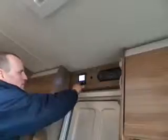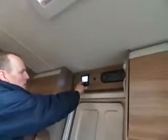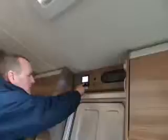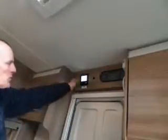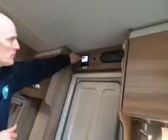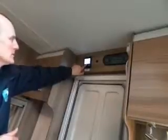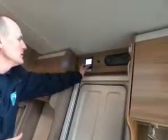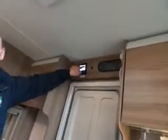Say you switch it off at 10 — hours and minutes. It'll then ask what heating temperature you want, what water temperature to set, what energy you want to use, and the fan setting — eco or boost. It may not give you boost if it's already warm. The fan on boost shows all four blades covered on the top line. At the end it gives you the option to switch the timer on or off.